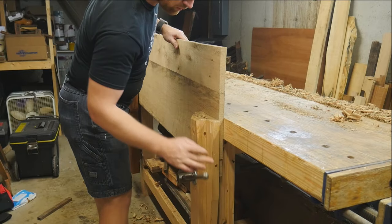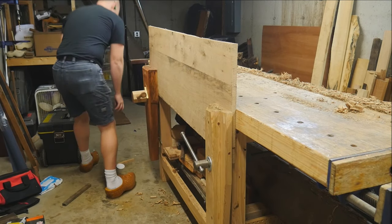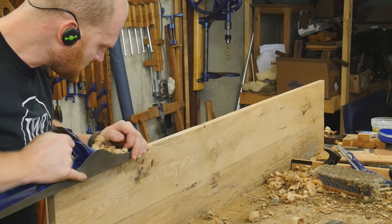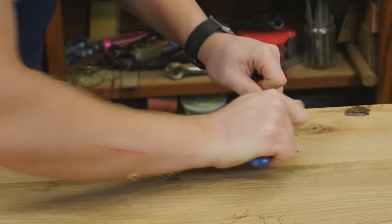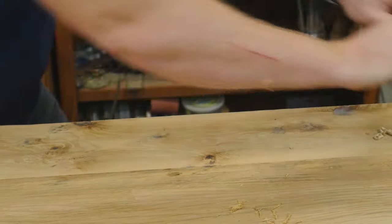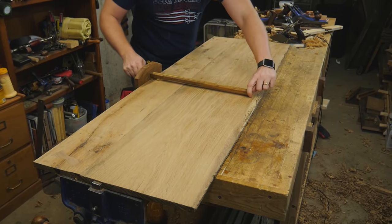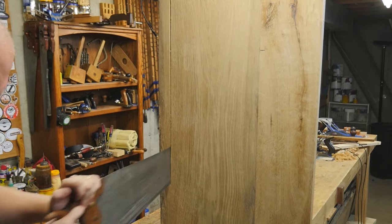After flattening, I can start making this board the final dimensions it needs to be. This is one of the few times where I actually use both leg vices, and I really like how they just hold it in place — it will not move, there is no bending or bowing in the board. I like it so much better than a dead man. I can joint off the front edge of the dresser just like I would for the boards, except I'm not fitting it to another board — I'm just getting one flat, smooth, jointed surface all the way across the front. I also added some epoxy into a few of the knots and cracks just before the final smoothing. The cabinet scraper takes down the epoxy very quickly and leaves a nice smooth surface ready for finish. Then I can rip it to its final width using the panel gauge I recently made, which gives me a perfectly parallel mark to the front edge.